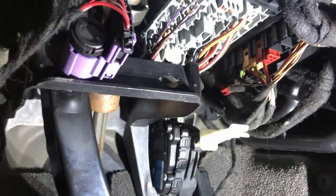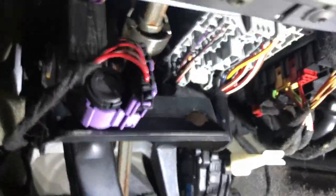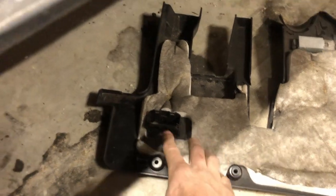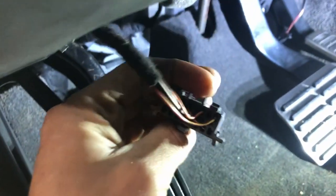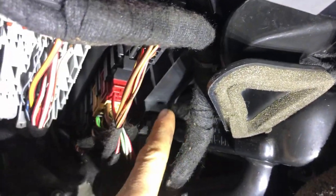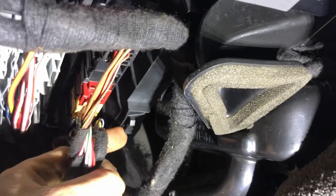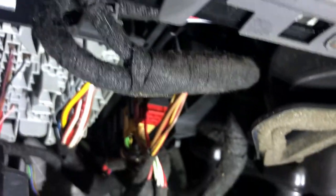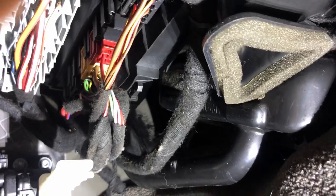If you have multiple antenna failures, that's a pretty good indication you've got a KESSY issue. So I'm going to get VCDS out of here and take this apart. We're up in the footwell here — we've got this panel out. You've got those two bolts there, the OBD2 port just comes out with a couple little clips you pry, and then just that light. This is your body control module, and the one beside it right here is your KESSY module. It's got two little clips — pop them apart, then they'll come over and we can get the harness undone.